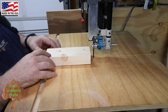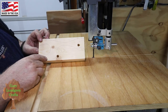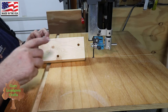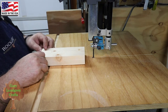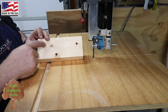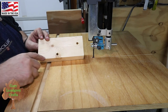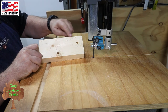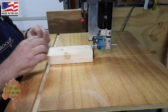Here at the band saw I'm going to cut out these patterns and trace around the lines that I laid out. I've got two 3/8-inch holes that I put on this to help me in the tight radius of these different cuts. Usually I start cutting between the horns here and then between the legs. Then I'll cut this long length around to the back of the tail and down. Lastly I'll cut this long narrow part on this edge here, then put the pieces back together and tape them up.